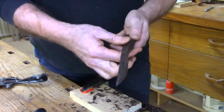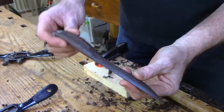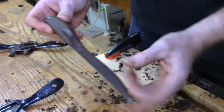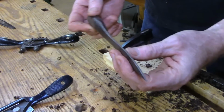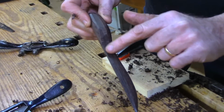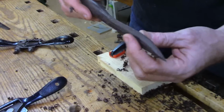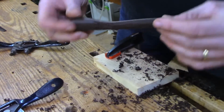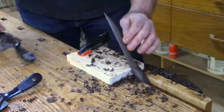Oh, okay, so check it out. It's starting to take shape. See? We've got our handle. We've got our blade is thin. I'm not quite all the way. I'm going to do a little more there. Got to take a little more up this side. And then you can see where it's a little rough in here. I can't quite get the spoke shave in there, so I'm going to just rasp quickly that clean. So let's put it right back in. Just touch up that knife edge.